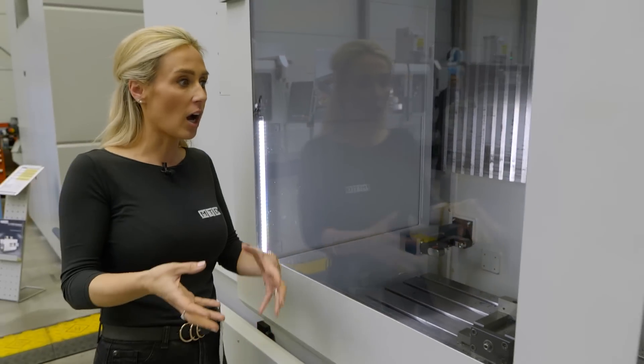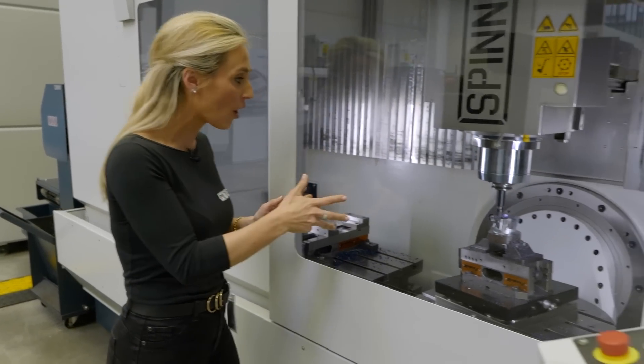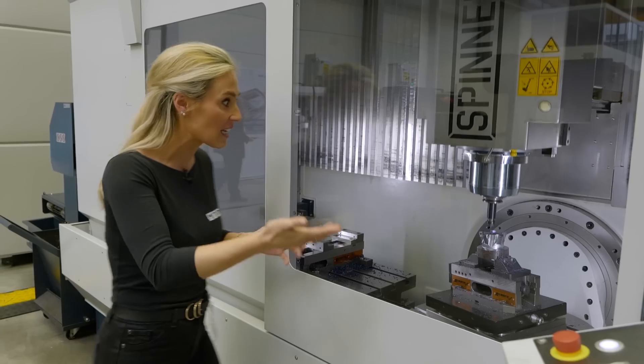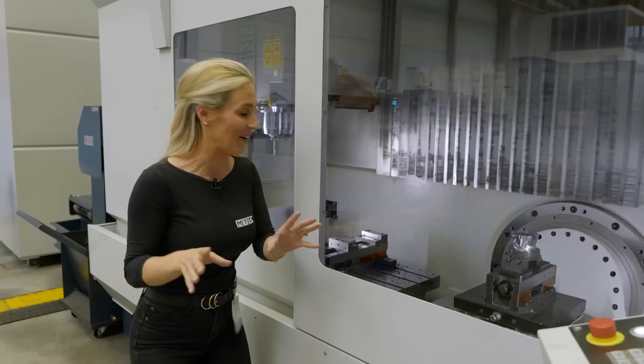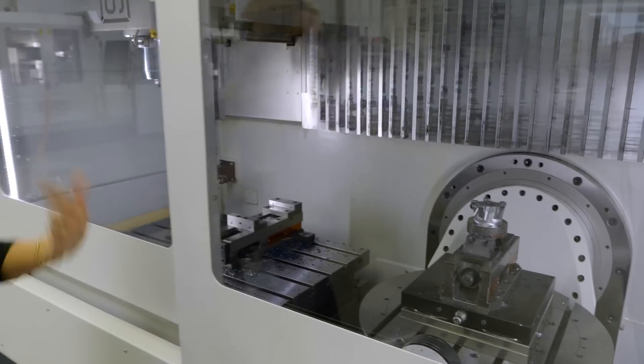What they were telling me really opened up the possibilities. Yes, you've got full five-axis work, but if you want to hit the sixth side — the sixth face — you can do your operations on this table and then pull the part over to the other table.